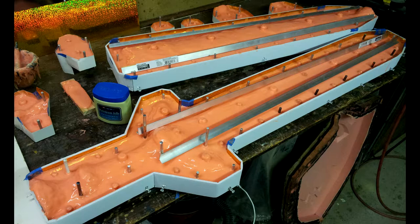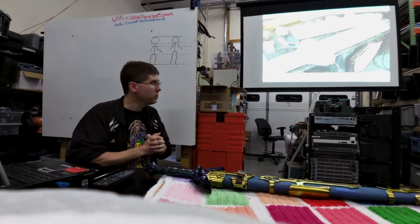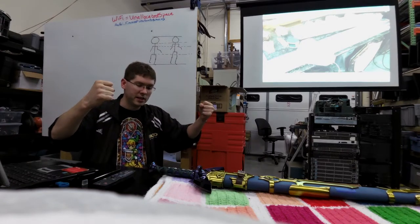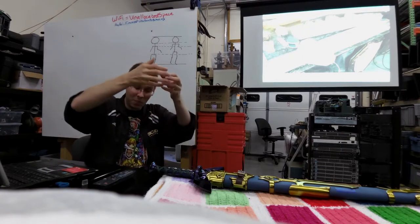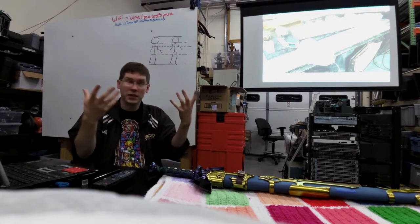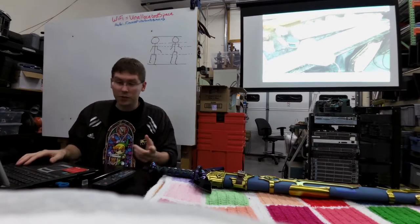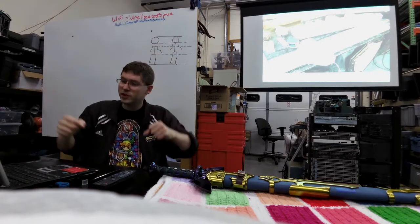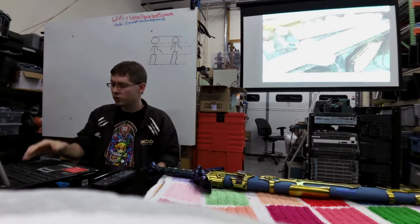Once the pours are done, I put aluminum angle irons in there because rubber by itself is just floppy — when I first made my first sword mold, I peeled it off and realized they're just floppy pieces of rubber. There's nothing holding them together to keep liquid from coming out. You need a shell to hold those rubber pieces together — a mother mold. To make the mother mold strong for the sword's long length, I put angle irons in so the mold doesn't bend over time.